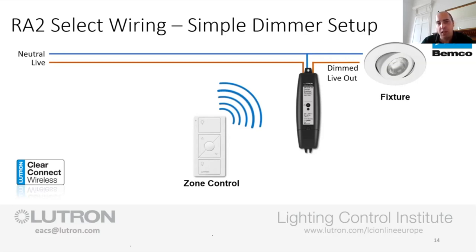But yeah, as I say, on the dimmer side of things, we've got that sort of soft start that helps with the high inrush, because obviously if something comes on at full straight away, you're just whacking all that current straight through it. Whereas if you're soft starting it up, at least you've got that ability to just ramp it up slowly.